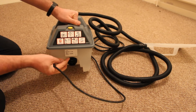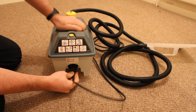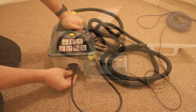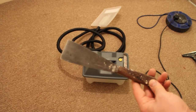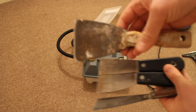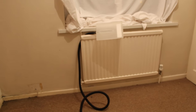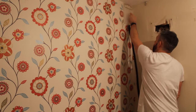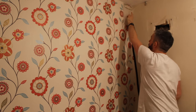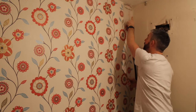On the back there's a clip to stop the water getting in there — push that in and make sure it's right in there with the clip holding it in place. It's starting to boil. We've got a couple of scrapers handy — a little scraper and a couple of other scrapers. You can hear it now and see the steam, and a little bit of water dribbling out. That's why I put it up higher than the steamer, just to stop any water spilling. Hold the steamer against the wallpaper with the hand you're not going to scrape with — I'm right-handed so I use my right hand to scrape.